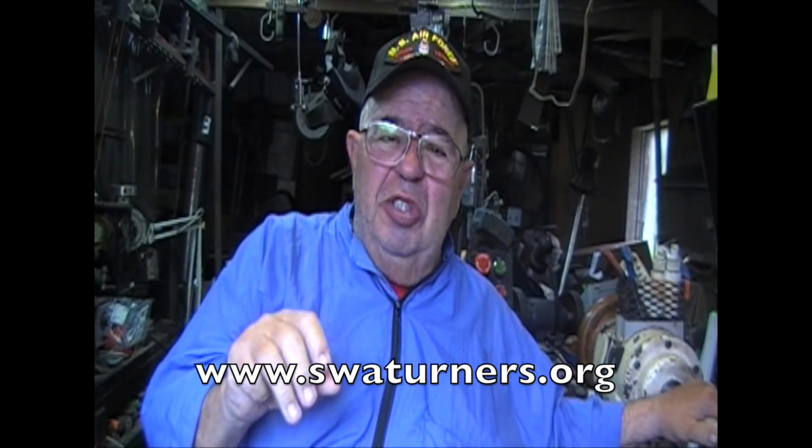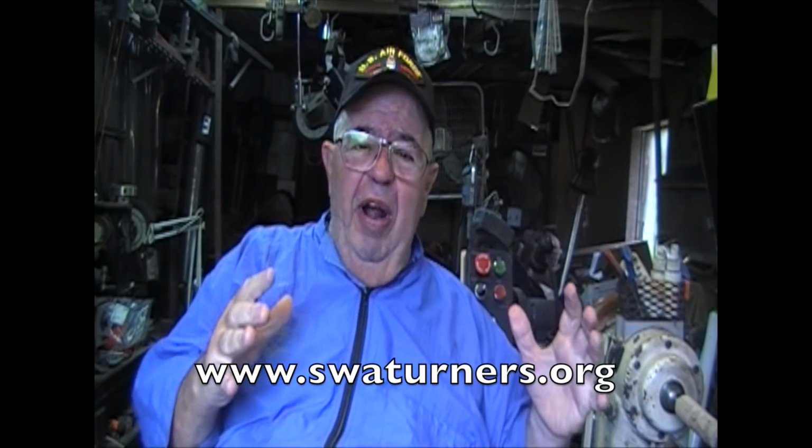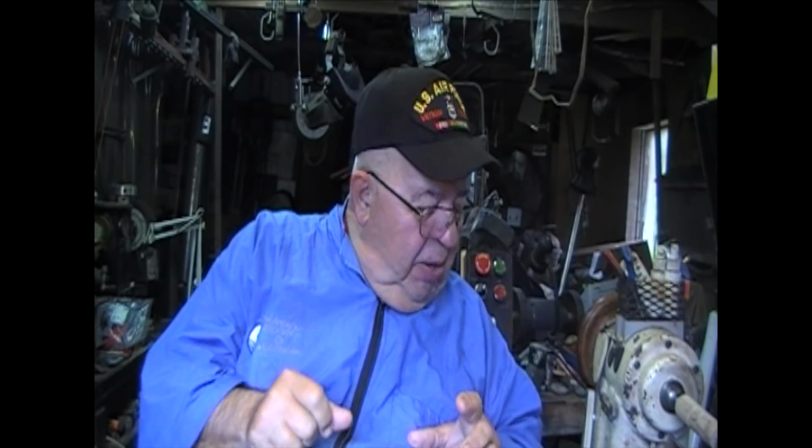But I don't want you to sit there and watch the vase or the jar or the bowl or whatever Ashley's turning. I want you to sit there and watch Ashley turn. Yeah, when she picks up the gouge and presents it to the piece. Watch how she presents it. Watch what angle it attacks. Watch how it rides the bevel. Watch how she cues in. There's no choo choo choo choo. That doesn't happen. She understands how to cut the wood. She learned it from some of the best, and she's expounding on that and showing it to you.